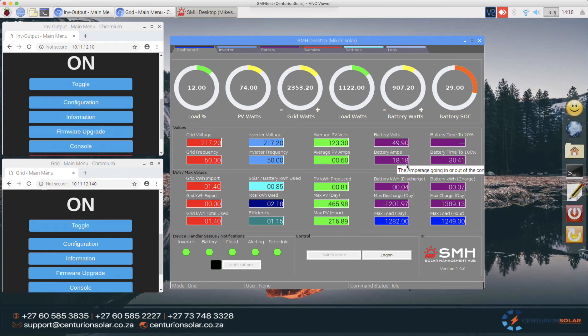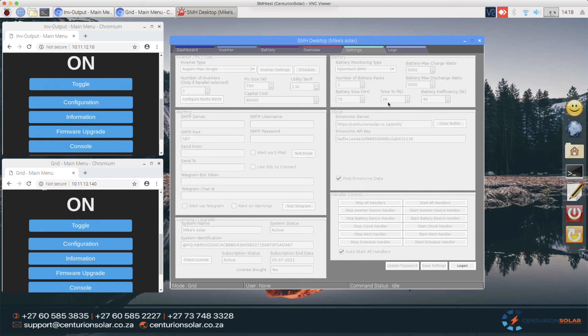As the battery amps count up, the estimated time goes down — so it's showing about 17 hours. It recalculates every two seconds to get to the answer, so as time goes by this will get shorter and shorter. In about 15 seconds or so you should have a fairly good idea of how long it's going to take to charge your battery.